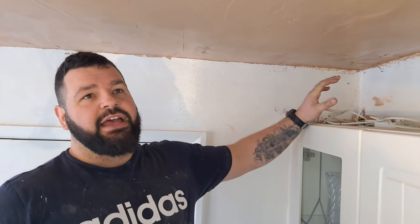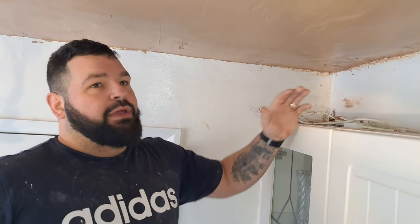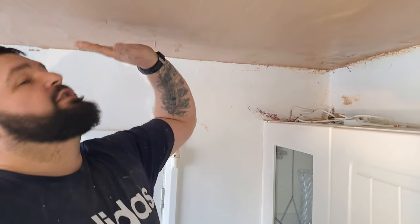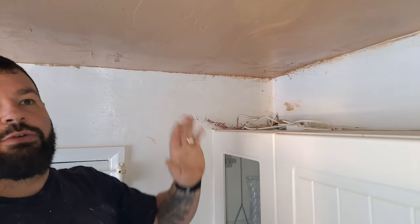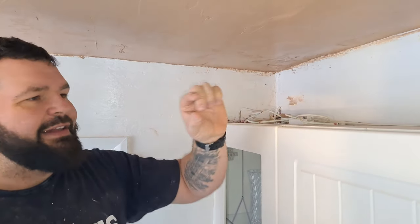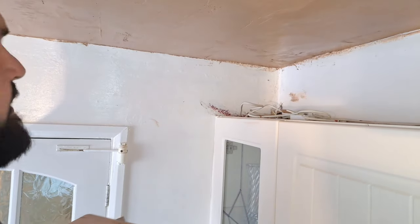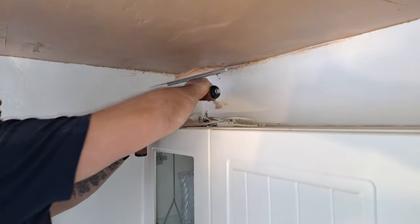This part of the ceiling has then had basically four coats of plaster. Now that's not ideal for finishing plaster to go on that thick because it ripples. But look, I've let the first coat go right off, and that's the majority of the thickness done. So we're not going to struggle with that now. If I was trying to go over that when it was soaking wet and it was this thick, we'd have all sorts of nightmares. But because I've let it pick right up, we're not going to have a ripple problem. It'll be fine. So I'm going to start now building this out again